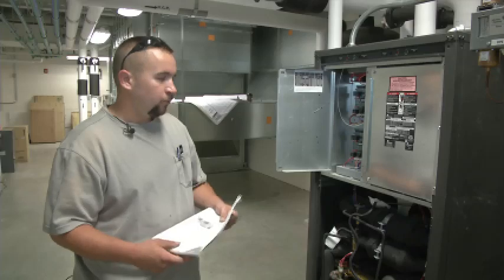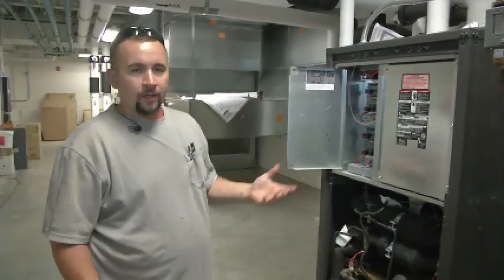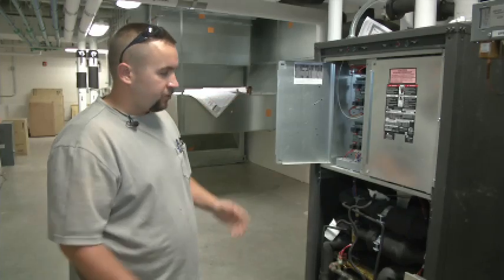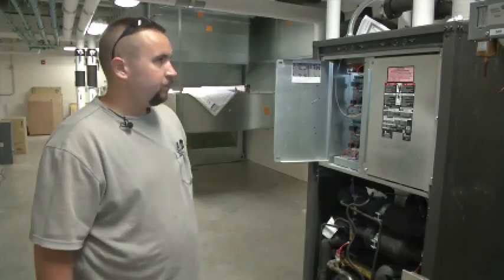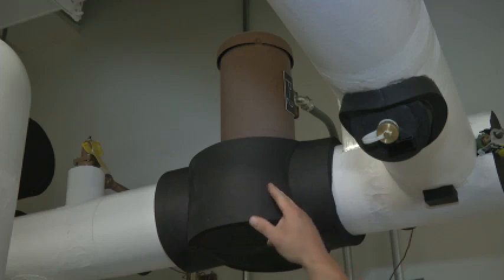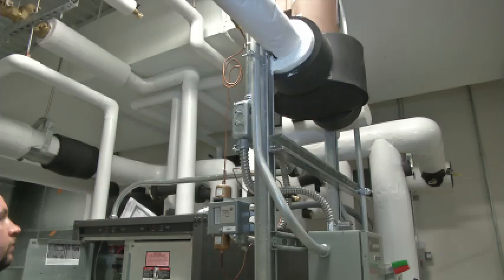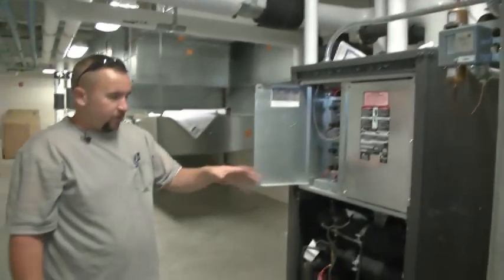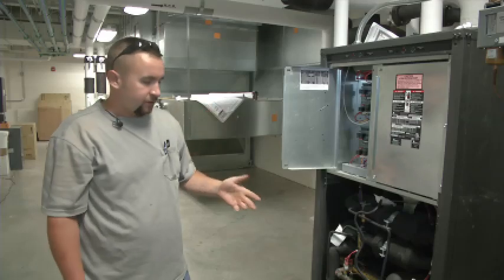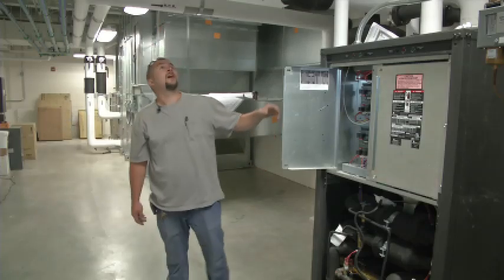This particular unit is a water-to-water heat pump, which means it's bringing in the ground loop as its condenser and the other water side is going to a coil in the air handler. It's two separate water systems with its own self-contained pump here — no grease ports or anything. It works off a pressure differential, and the building automation is going to call for whatever set point it needs to run at and cool the water down, just like chilled water, with the ground as the condenser.